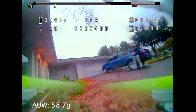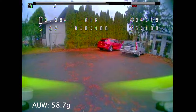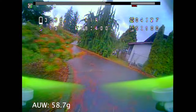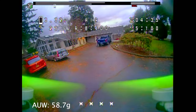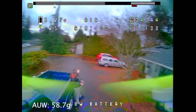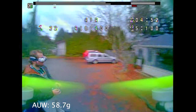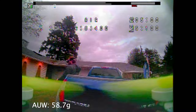You can see flashes from the Fusion module putting the image back together — color flashes, distortion, all sorts of things like that. At the edge of range, the screen will roll with both a TBS Fusion and a Rapid Fire. This is about as good as analog can get in terms of visual fidelity — this is with the HD Zero goggles and a TBS Fusion in the analog module. The de-interlaced video is coming through the goggles live, so there's none of that Orca goggle situation where it looks really good in DVR because the DVR is de-interlacing the video, but in real time it's not. These goggles are basically showing exactly what you see in the video, which is pretty cool — Carl was able to do this real-time de-interlacing.